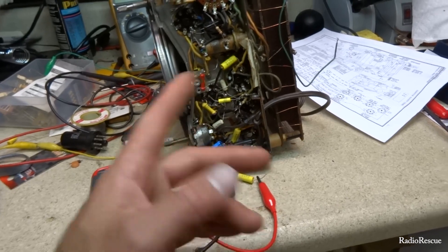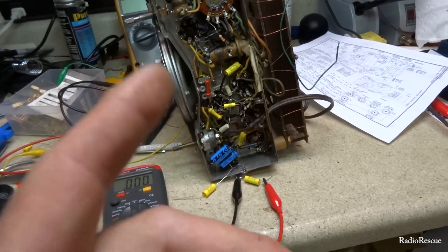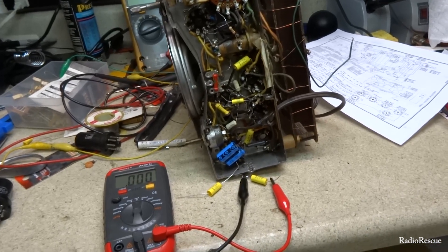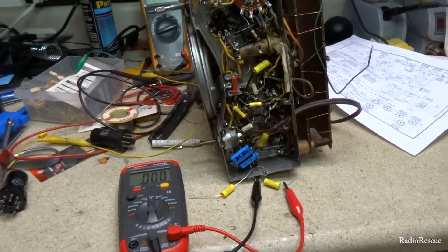If you're working on sets, just because it's got new capacitors, don't assume they're good. I normally don't assume that, but I was scratching my head running in circles on this one. Hopefully replacing C6 will fix it — we'll find out.